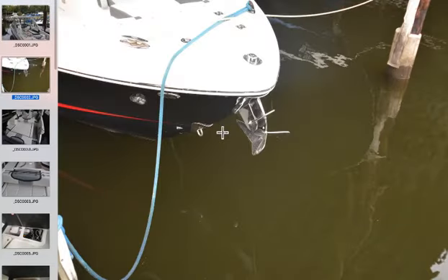This is a quality touch that not everybody uses — actually there are three of them displayed here. Number one: the bow scuff plate, so if you're trailering the boat you don't dig into the fiberglass. This is a hawse pipe — a lot of builders will just mount an anchor on top of the deck with the windlass, but then you don't have a clean deck. A person could step off the front of this boat without a tripping hazard, though it costs more to do that. The stainless anchor is also a nice touch.